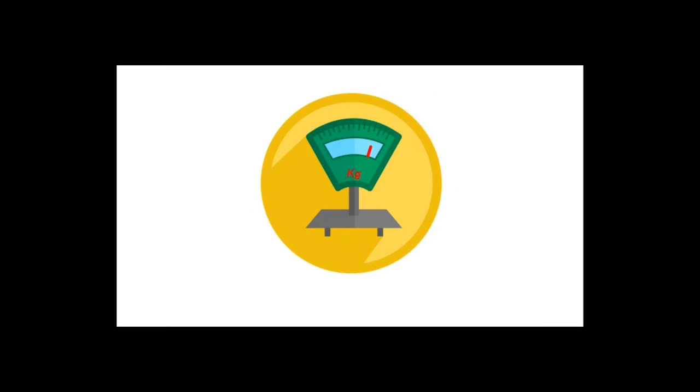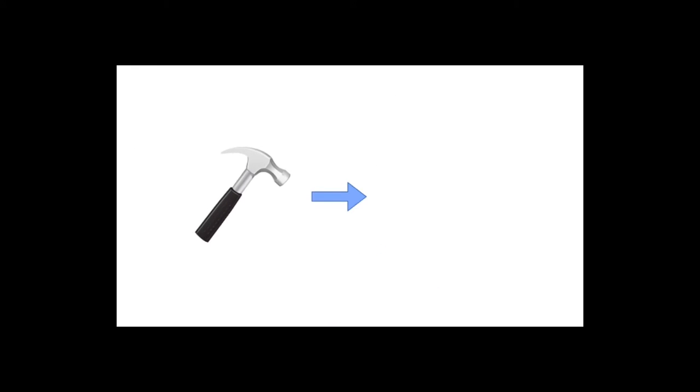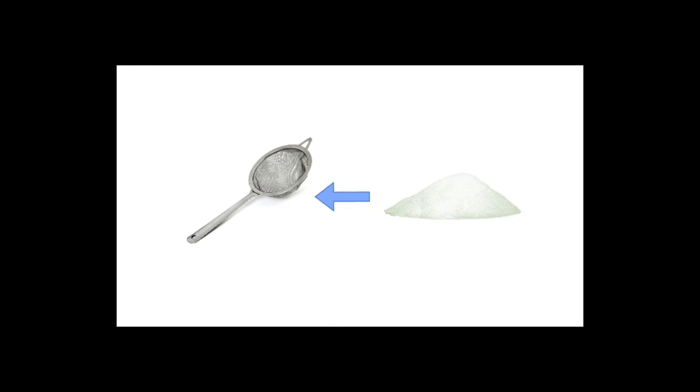With that in mind, determine the mass of AMLA needed, and under a chemical fume hood, weigh out the alum mud, bauxite, and sulfuric acid, and mix these in a plastic tub using a Teflon spatula. Allow the mixture to dry for 4 days, then grind the friable solid into a powder and sieve it through a 20-mesh sieve.